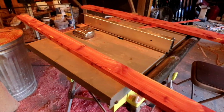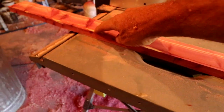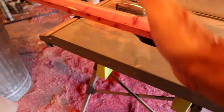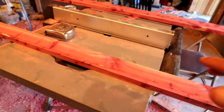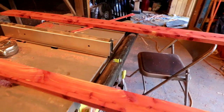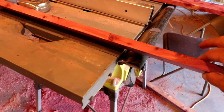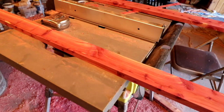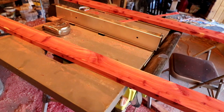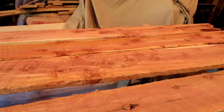First of all, you have to watch with your planer and you'll get some of this white. It doesn't have enough white in it, and it has a bow in it like this. If the top had that, it wouldn't be a problem. My other board will take that out. The bottom more than likely isn't going to have one. So this, which is right now planing down to the same thickness as what I did those spindles or slats, this one will become a spindle. And I will find a more exciting board that I think looks better.